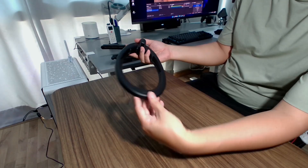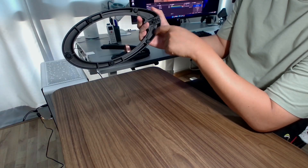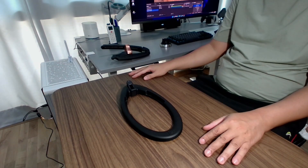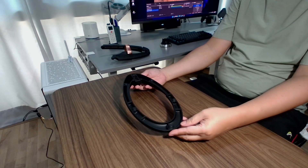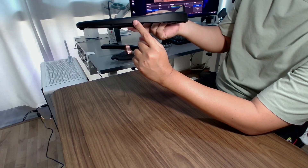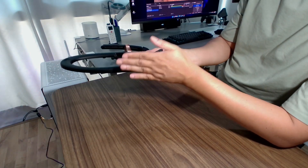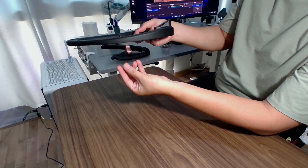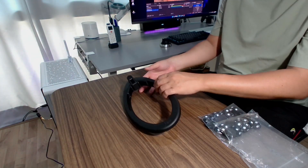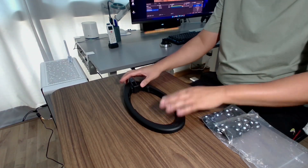I start with this one first. It has an oval shape and in the back there are some deeper grooves. I want to see if the scanner can detect the groove inside. I will scan with both scanners in different modes — flat plane first, then flip it over to scan the underside and merge them in the software. This could be difficult to merge because the walls on the side are parallel to each other; the only overlap area will be those parallel side walls. I will scan this without applying markers directly on the object, because when the software removes the markers it doesn't remove every one and it's difficult to clean up. So I will just use these triangles.